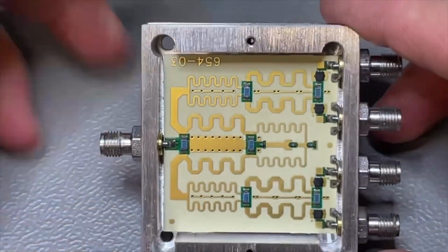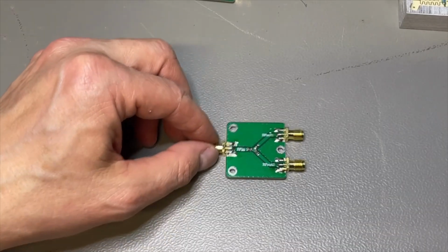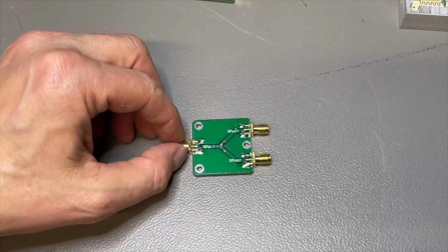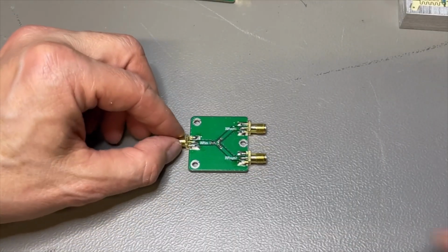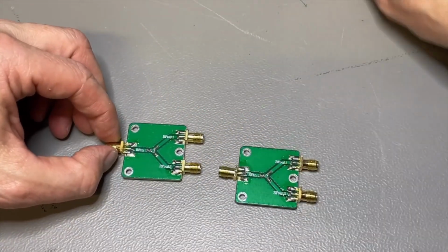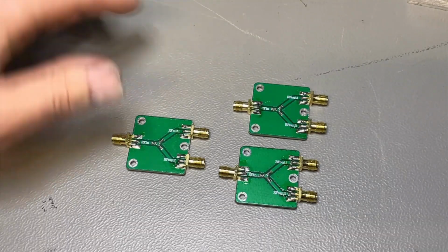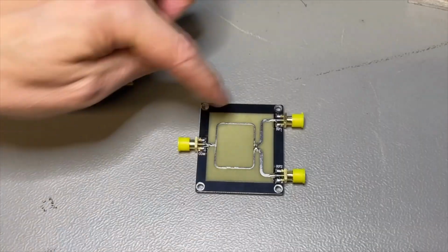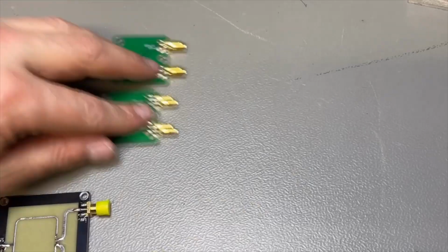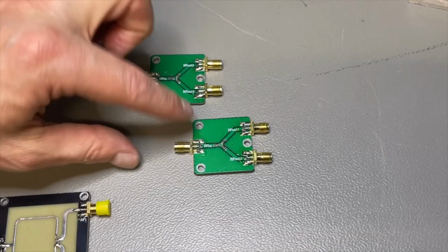Why would you do it so complicated if you can also do it like this? Well, the answer is very simple. This one is great because it has a very big range. Now it can go from DC to the gigahertz range, but doing it like this, you lose like 6 dB. So if you want to go to 4 channels, you already have 6, and 6 more you lose 12 dB. And with these, you only lose about 3 dB, but also the isolation between the channels is a lot bigger, because here the isolation between the channels is only this 16 ohms.